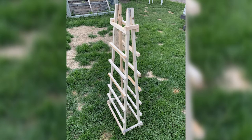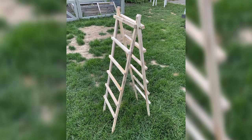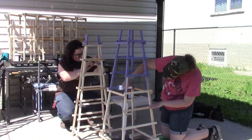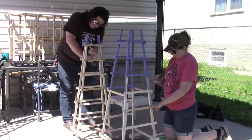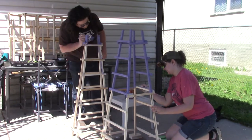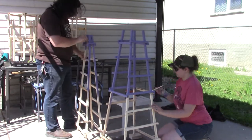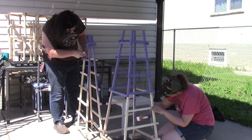The four plant holder upper trellis type devices are effectively done, but since I'm not 100% sure what kind of wood this is - probably spruce pine or fir, or SPF - it won't hold up great to the weather. So to give it all a little bit better of a chance, we gave it all a coat of paint. Danielle wanted purple - it's more like lavender or lilac, but... purple. It won't be the be-all and end-all of weather protection, but it's better than nothing, and we should get a few years out of these at least. Which, for what we paid for it, basically just the paint, works for me.